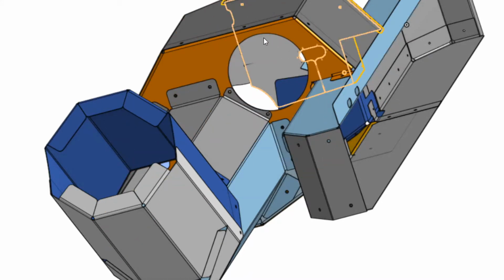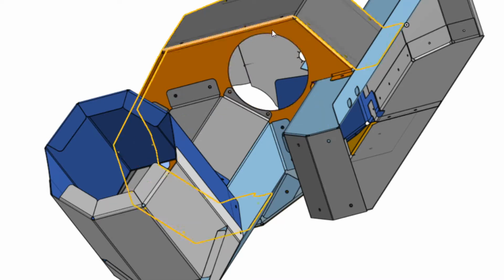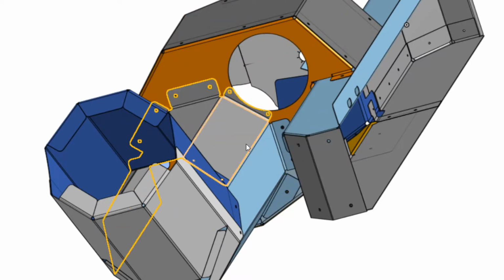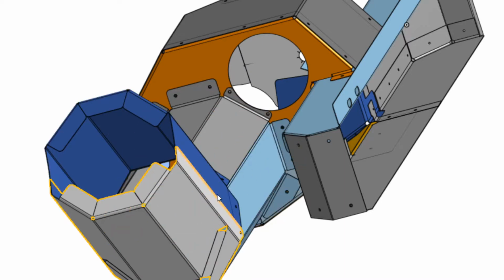That connection is done with a little HVAC stub entry fitting that has fingers you can push inside and bend out to lock it on, and then I'd shoot a couple screws through a couple of fingers that you apply to the outside. And then you may want to use what I call a flex 90 or a swivel 90. It's a galvanized HVAC fitting that can go anywhere from straight to 90 degrees depending on how you swivel the different rings in it. And that could go onto that stub entry, and it can allow you to shift the hole up or down or in or out as you need in order to line up well to come underneath here.